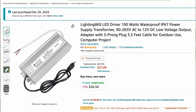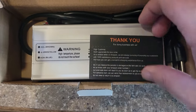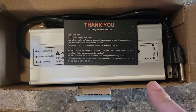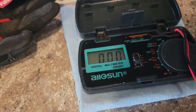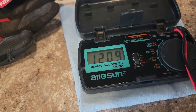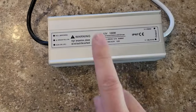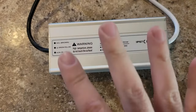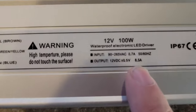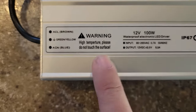So what I'm going to do instead is make sure I never have to use that bypass router again. To that end, I got this 12 volt power supply, and I opened it up and saw this little thank you note — I like little touches like this. Let's check the voltage output: pretty good, 12.0 volts. In our earlier video we determined that the whole Starlink setup was drawing about 5 amps, so I wanted 12 volts DC at something above 5 amps — this one says 8.5 amps, I'm happy with that.